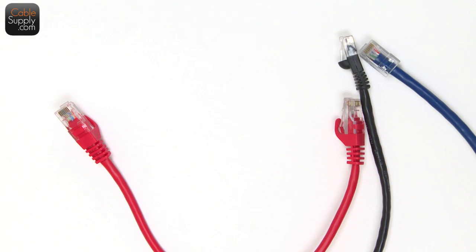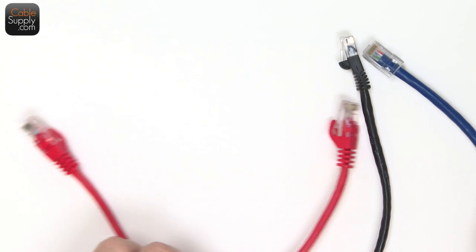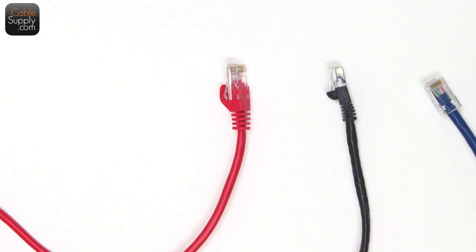If you're going to take a patch cord from the wall to the computer, the standard is 10 foot, even though you sometimes get 6 foot and 7 foot cords with computers. Really, if the computer's anywhere near the jack, it's 10 foot. Sometimes people order cables that are 200 feet long, and it's like, why don't you just cable it? It makes more sense to pull a cable and put a jack on the wall and use it.